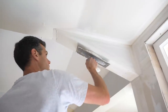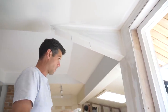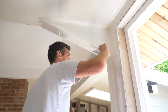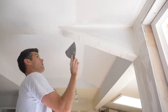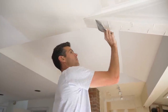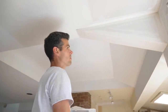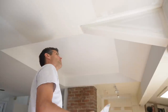We've got this little spot right here - I mentioned in a past video how to take care of those short little 45 degree inside corners. We don't need to do too much to it right now. We've got this guy - I'm just going to do the old side swipe. I can't believe we were planning on doing the whole day in one video - this alone, we've got another 20 minutes here maybe. So we need a little more right here. Because these little four inch ones are so short, you can kind of create that corner just with your knife. And you can sand them easier too.